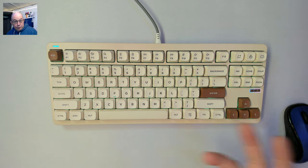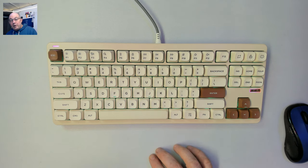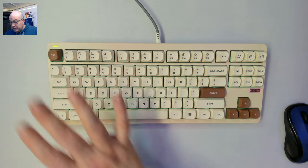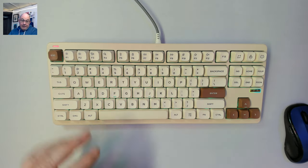It'll allow you to, I mean, if you want to do per key RGB, I'm guessing this MCU is more than capable of doing that. But you can program it in the RGB, change the colors of what the caps lock are. You can do a lot more configuration with QMK. You can also create codes that you can call from the Via key map in order to activate those, especially if you want to create some predetermined per key RGB layouts.